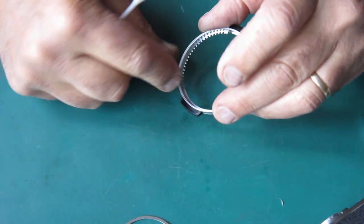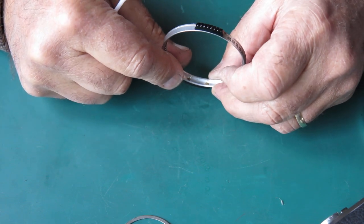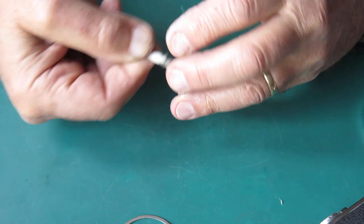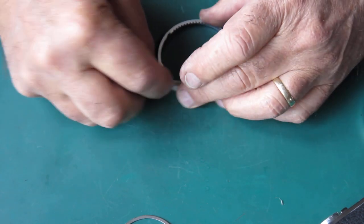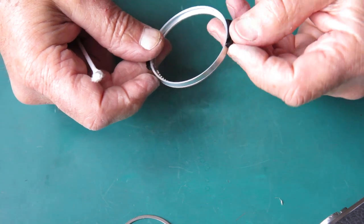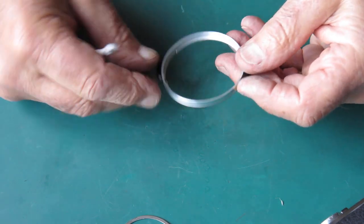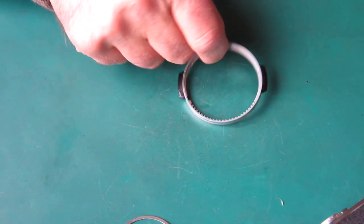These little plastic pads for turning the shutter speed — it's not uncommon for them to be cracked. Typically if you slightly loosen the screws, put a drop of super glue (cyanoacrylate) in there, and tighten the screws up again, you'll find that the plastic bonds together very well. Unless there's a piece missing entirely, I wouldn't bother hunting for a parts camera for a replacement — chances are any replacement you find also has a crack. This one unusually doesn't appear to be cracked. Watch out for solvent on that plastic too — naphtha appears to be okay, but don't use anything more volatile or you'll lose your nice shiny plastic.